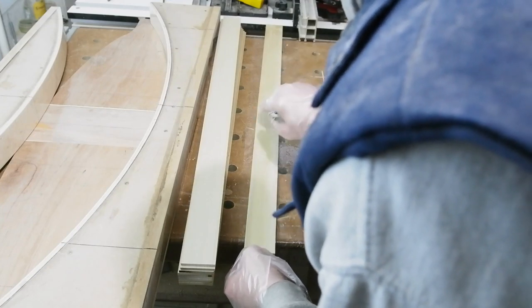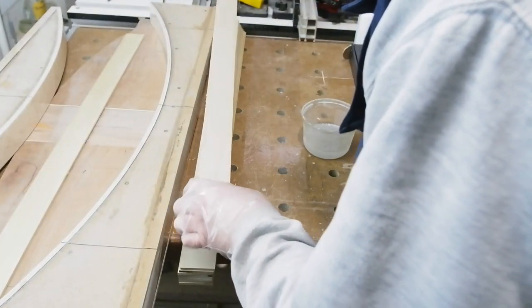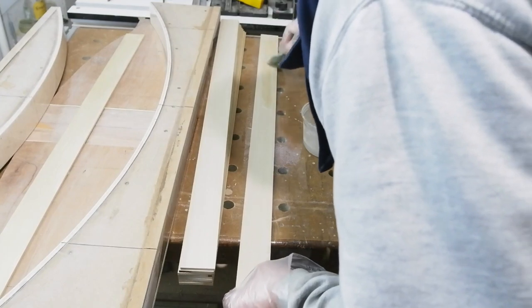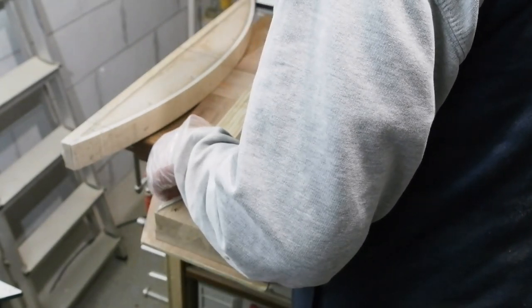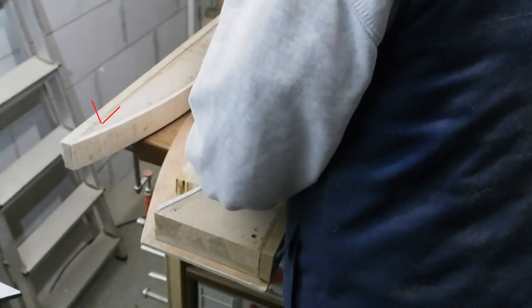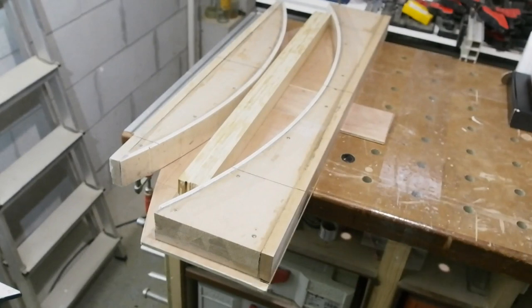All being well, the pieces get a liberal wetting up — just one side of each piece is sufficient as long as you've given it a good coat. Take care to keep the order and orientation right as you go. The little spatula I'm using is a silicone one, perfect for the task on pieces of this size — £2.50 from any good kitchenware shop. I'm lining the pieces up here; they're about 50mm longer than they need to be each end. I have the approximate finish length marked on the form, and I'm just making sure those marks fall well within my lamination.